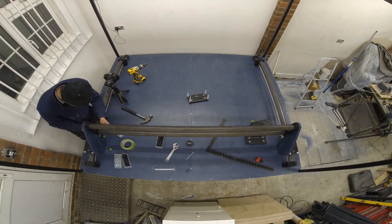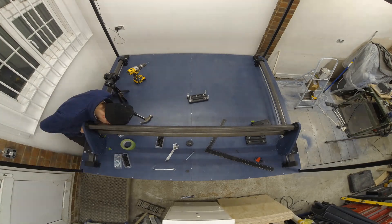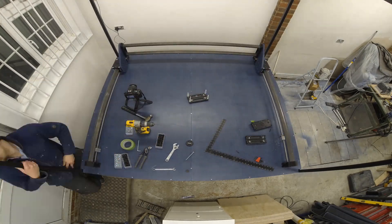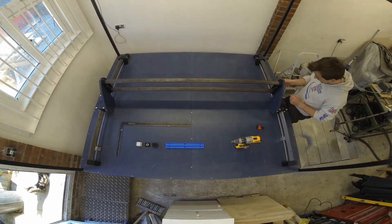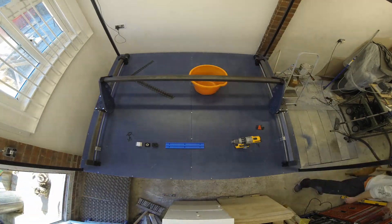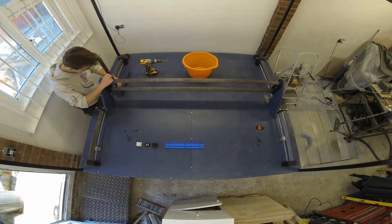This is recommended over using standard washers as it reduces the chance of crushing the plywood sheet. The plastic parts that hold the x-axis box section together have a left and right side, very similar to the y-axis, in that there is a motor side and a floating side. These are the FF and FK sides — the FK has the motor fixed to it, and the FF just has the floating bearing.